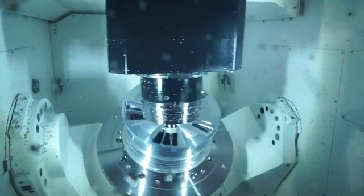Adrian, I'd like to explore, for my own benefit and for our viewers, what OpenMind's Hypermill software delivers for machine tool companies and machinists. Okay, in the case of this Variaxis i700T, it's a very dynamic machine and we're able to use Hypermill to really get the best out of the machine tool. So Hypermill is able to, in one environment, program the turning and the milling, and milling can be 2D, 5-axis, or in the case of some of the cycles or options on this part, we're able to use the simultaneous options but auto-index them.